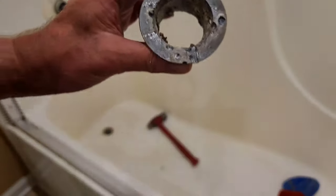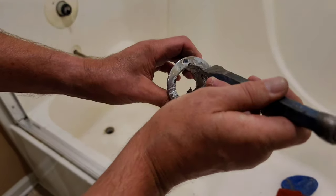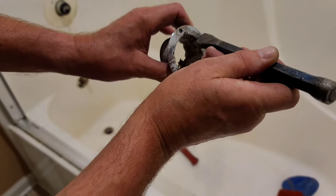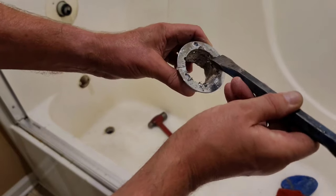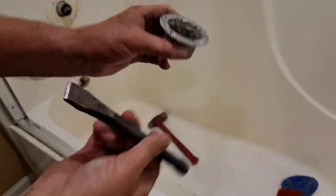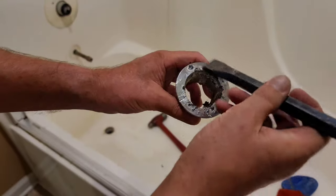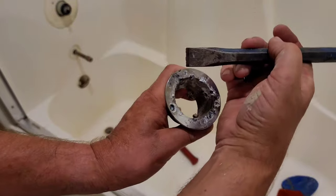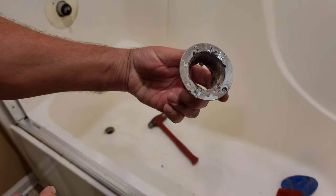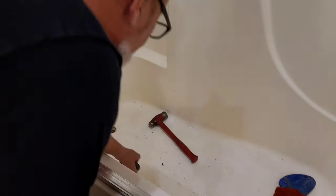I thought I'd show you a little bit closer after I got it out to explain it a little better. What you do is just take your hammer and hit this cold chisel — a sharp-edge cold chisel — and dent and make a mark where you can then take it at an angle and tap it in the direction you want it to go. Righty tighty, lefty loosey. I also drove another one on the other side because once I go so far this way, it would bind up from all the pipe dope and stuff that's been there for 20 years. Just drive it back the other way to free it up, then do that again — go both directions until you get it freed. It works pretty good; it came out.